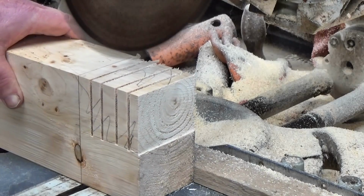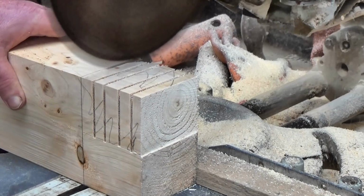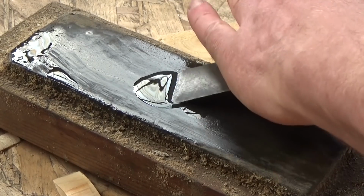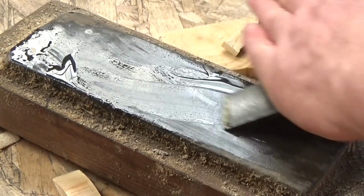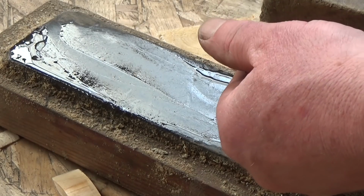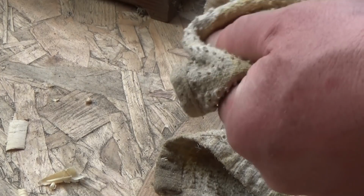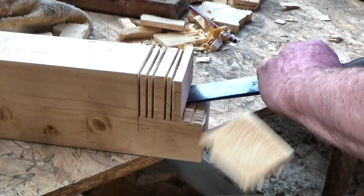I'm using the joint that's traditional for this job, a simple half-lap joint. That's because these wagon frames were never built to be tight and rigid. They were deliberately designed to be slightly flexible. That way the wheels were more likely to stay on the tracks, even when the tracks were uneven and bumpy.